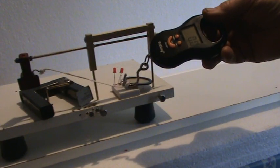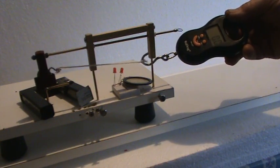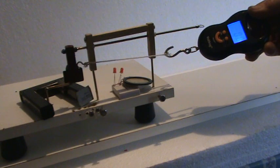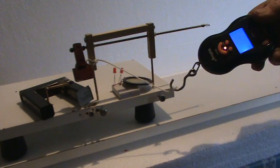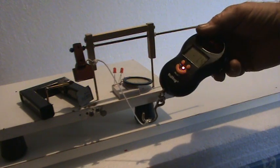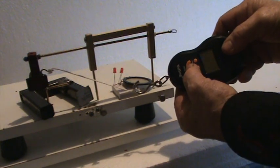We're set up for the second half of the reset cycle leading up to the firing point. The digital meter again is good to 0.1 ounce. So either half cycle — it's getting to the fire there. When it fires, sometimes it'll go negative. I'm reading negative 1.4 ounces. That's because that jolt makes a vibration through the string — instead of positive, it pushes the other direction. So it's negative 1.4, but really it'd just be 0, or less than 1.1 ounces.